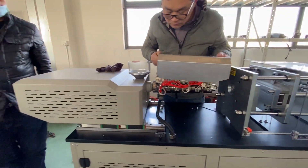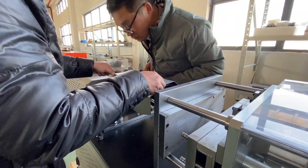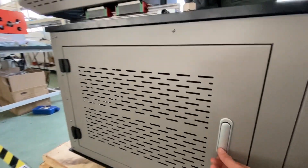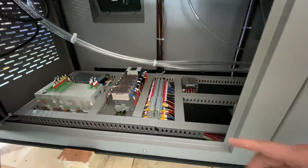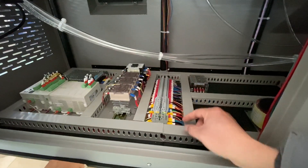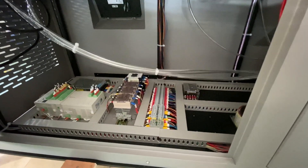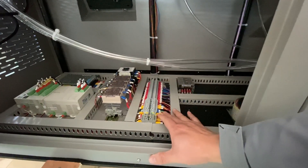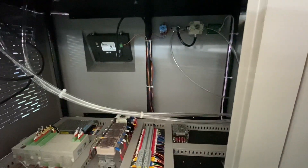So if we can read the temperature — first we need to check the connections. If the connection is good. Another step is that we need to check here, because there were many connectors, so we need to screw them to check if any are loose. We found that one of the band heaters was not going up in temperature. So now we found that the problem is resolved.